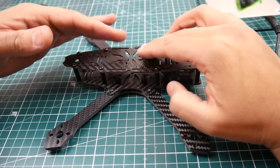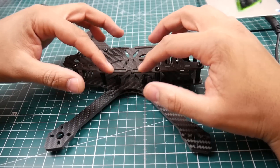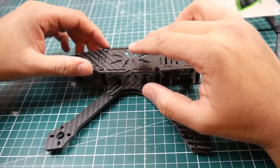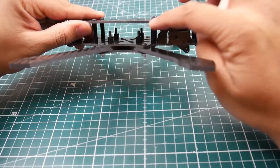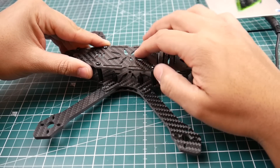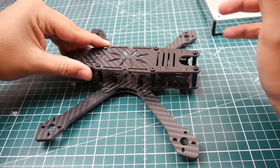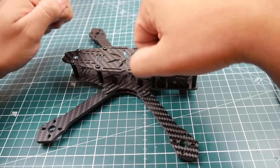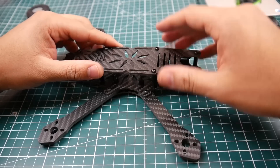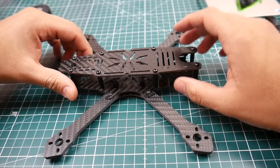They do give us a lot of mounting solutions. As you can see, we have battery strap holes right here ready to go, which is nice. Also take note when building this: try not to go too high so your battery strap has space and doesn't pop off components. Sometimes the rough side of the strap will go in and snap a capacitor off the flight controller, so take that into consideration.